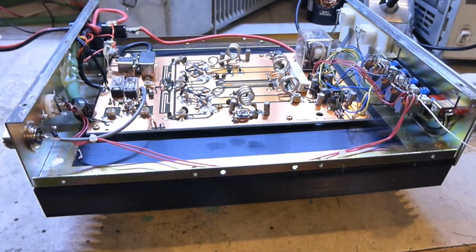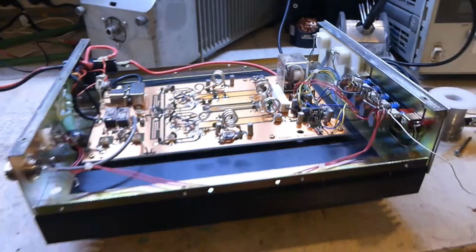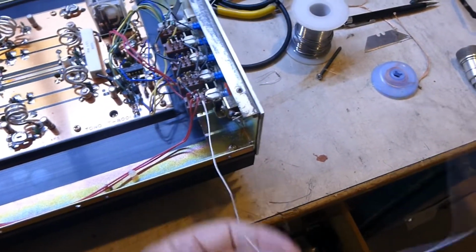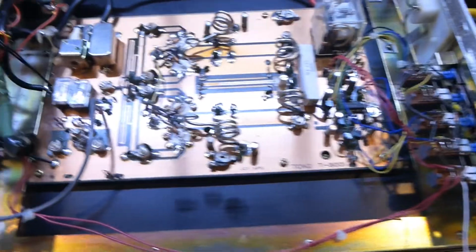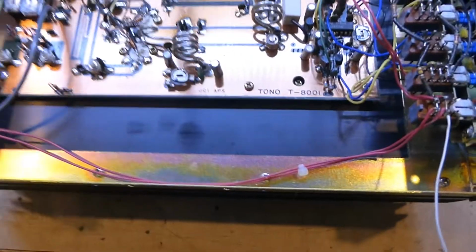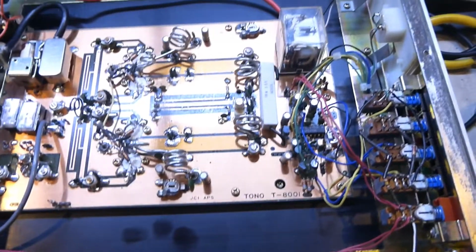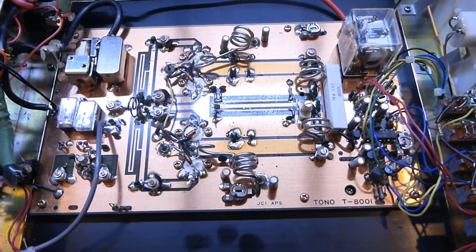Initially, we've looked at the circuit, and the alarms which deal with over voltage and the bad SWR, etc., are all achieved by use of a quad comparator down here, and using a cable from the 12 volt supply and a 10k resistor. We've gone around the comparator and checked that it is working as a comparator, and it is, so that's not the problem. The references for forward and backwards tripping are the potentiometers here. Now there's nothing on the web at all. There's a circuit diagram of this unit on the web, but there's nothing in terms of how you set it up and what voltage, etc.